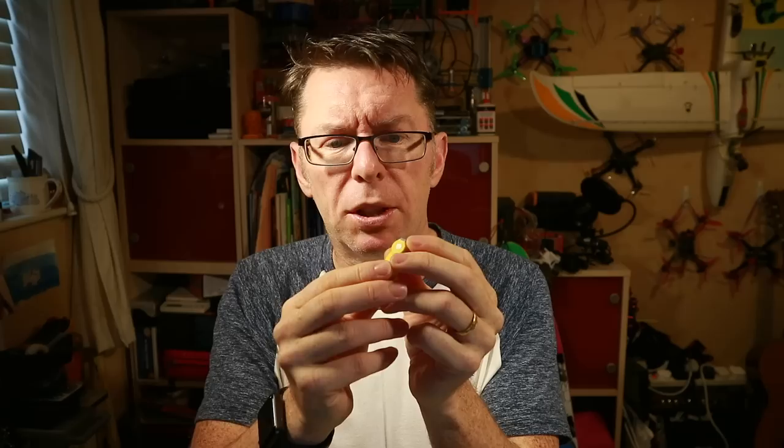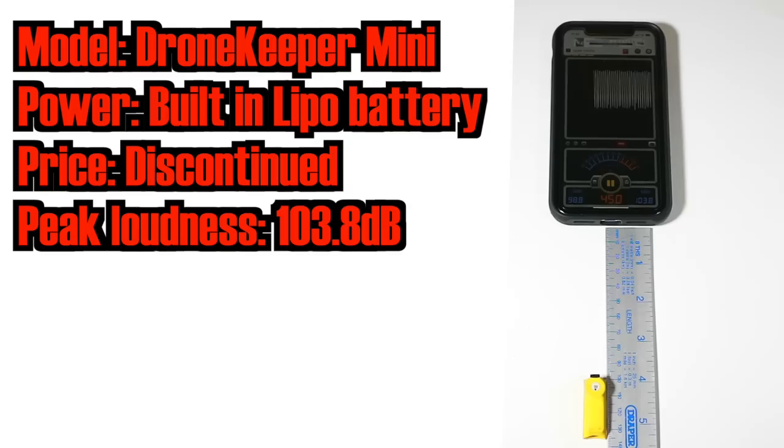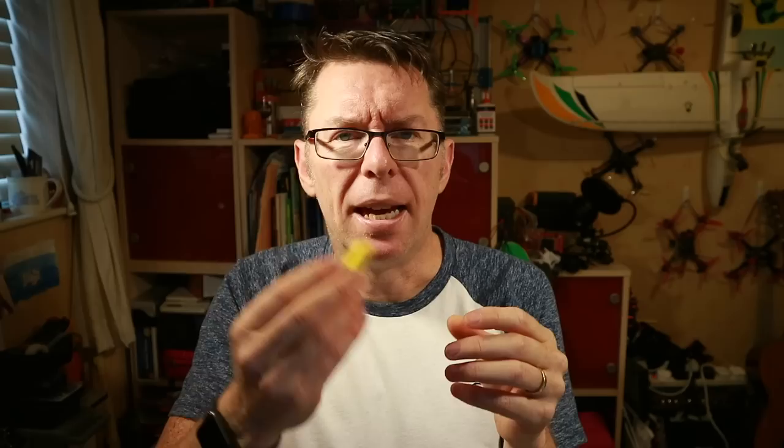This is the Drone Keeper Mini, and I've used it for quite a long time. It's from South Korean company Nishmol and they've gone through several iterations. What's great about it: it's pretty loud — I measured this at 103.8 decibels — emits a single tone, and has a built-in LiPo. On the downside, charging uses a USB adapter that goes into little pins, which isn't brilliant, and it doesn't work as a Betaflight buzzer. It was a very solid, very good piece of kit, but it's no longer sold by Nishmol due to restrictions on sending LiPo batteries through the post. So if you've got one, look after it.